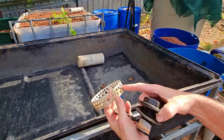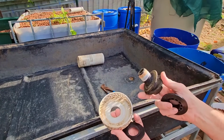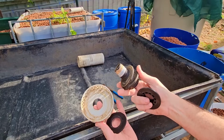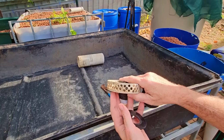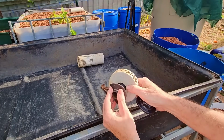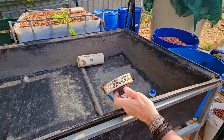I have an end cap here that holds the shroud in place so no one can pull the shroud out. That's that jobby over there. Simple tank fitting or bulkhead fitting. Put a washer on the inside of the guard cap, put another washer underneath, and that creates a watertight seal, and a locking nut underneath.